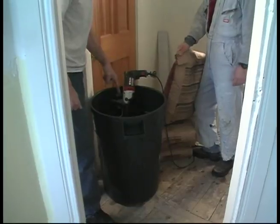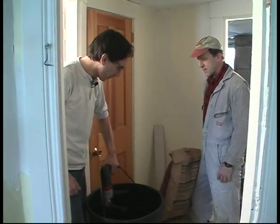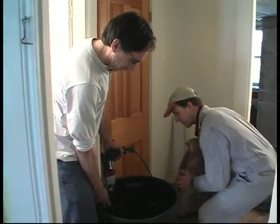And we have 6 gallons of water, and you put all the gypsum in? Yeah, I like to put the water in the container first, then add the powder to it. You get fewer lumps that way. Now, if I recall, I'm supposed to have this spinning when you're... Yeah, let's start her up.